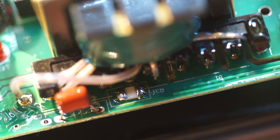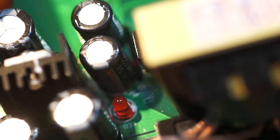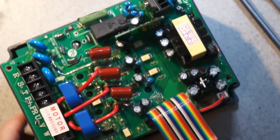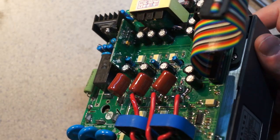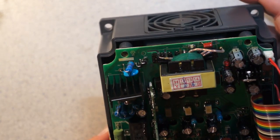See, there's even more transistor slots there, though. It looks like that is a hand-reworked resistor mounted upside down. Some leads coming out of there. There's another LED there. Let's see, who makes these capacitors? Let's see. What's that part down there? I can't make out the marking. So that is 25 volt, 1000 microfarads. I don't see a brand on it. Yeah, these are all JWC, I think. So all the capacitors are, I would assume, no-name branded capacitors. JWCO. But they are all, as far as I can see, 105C rated, which is at least nice.